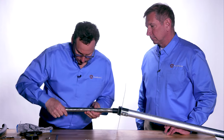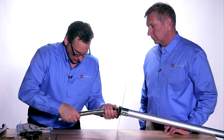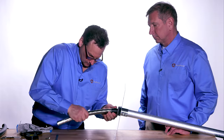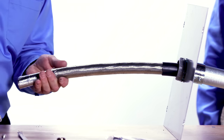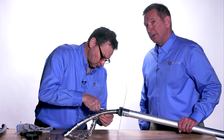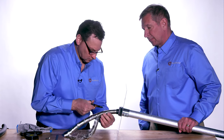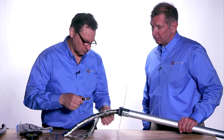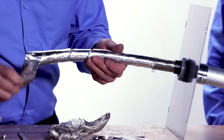The braid shield is removed a little differently. You want to loosen it up on the cable, then use scissors to make a slit. Leave about two inches of copper braid available to secure the termination braid to. Then remove the foil tape.